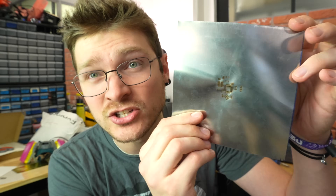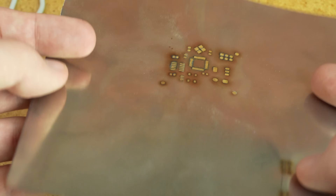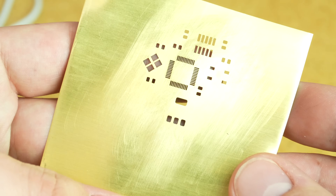Then I tried metal — if my fiber laser can cut metal, why not make a stencil exactly like I'd buy for production? Well, mainly warping. What a pain. Completely unusable — I didn't even cut all the way through and stopped the job because it was warping so much I knew I'd never get a clean stencil sweep. I even tried brass. I went to McMaster-Carr and found every sheet stock at a reasonable thickness for a solder paste stencil and bought one of everything. The brass actually cut really, really beautifully, but it's very thick and very hard to keep flat — and it's also very expensive.